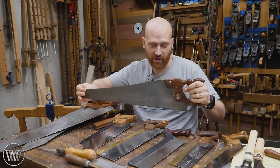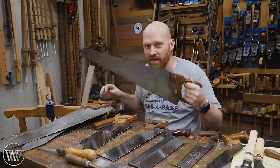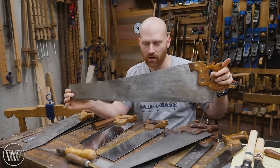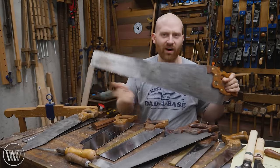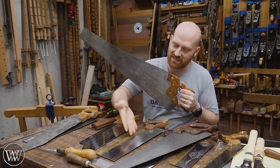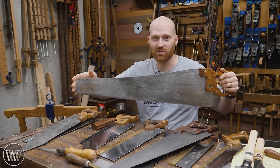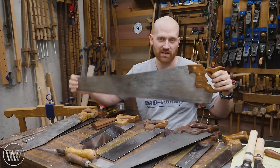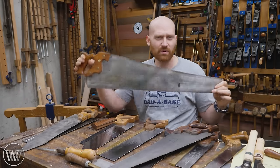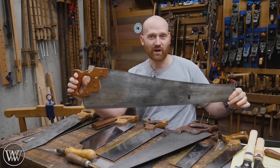This is officially a panel saw — usually any length saw up to about 26 inches that doesn't have a back on it. If you go larger than that, you've got what's called a handsaw. Yes, they're all hand saws, but that's the specific name of this one. A handsaw is usually at least 26 inches or longer, most of the time up around 30 inches plus, and most of the time these have really big rip teeth. These are the saws you use to rip the board down lengthwise — it's probably the second most used saw in my shop for breaking down stock.